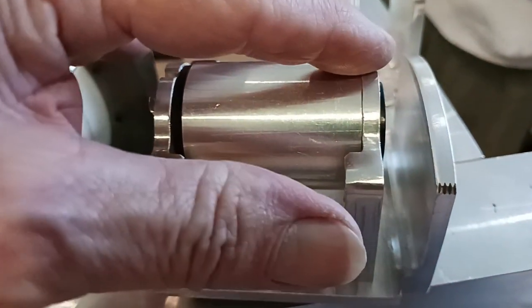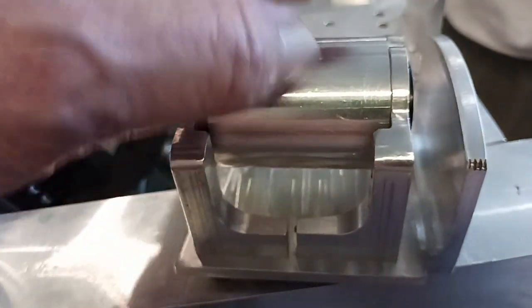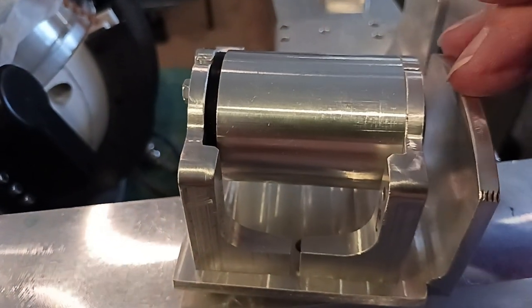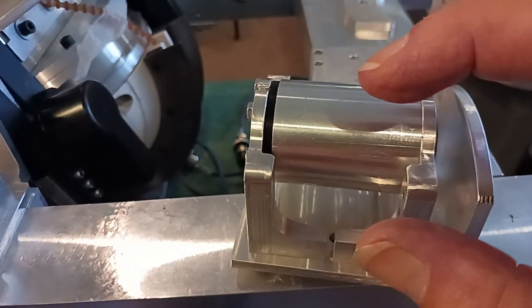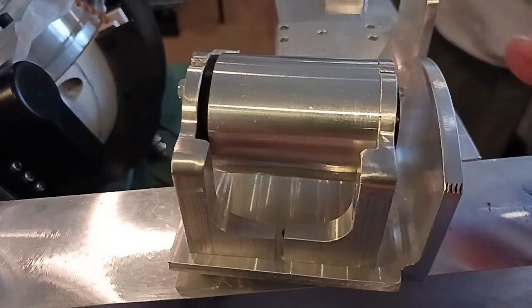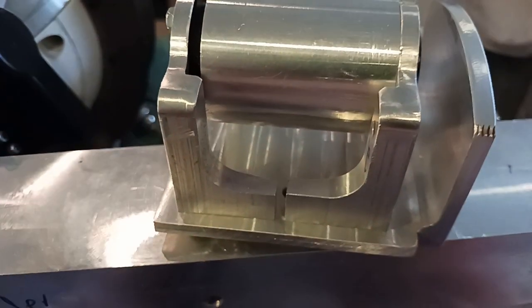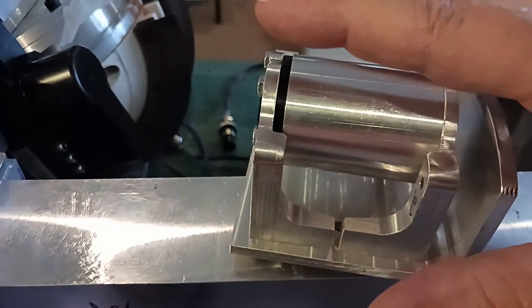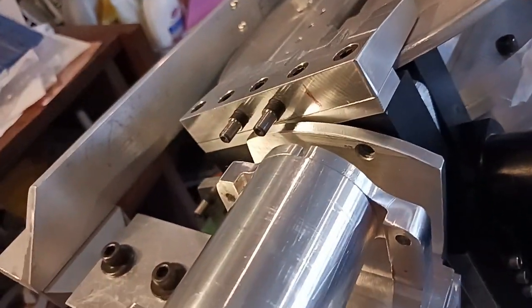When the piston activates it needs to move so the springs can retract it — to put some tension on the springs. If it's too far up it won't retract because there's no tension on the springs. It was too close and it wouldn't retract properly. So long story short, I had to make a new frame, move this piece back further, and give it more gap up front. Now we have something that's acceptable.